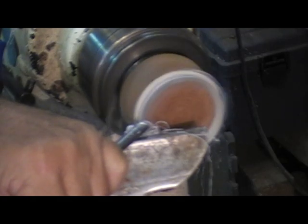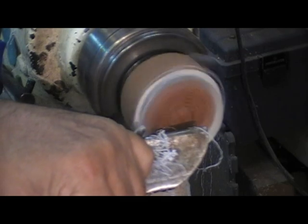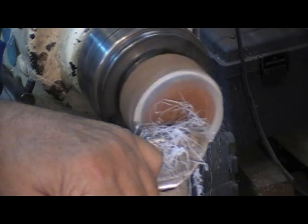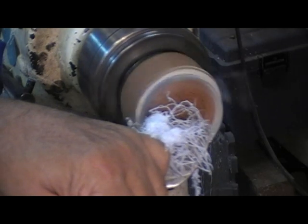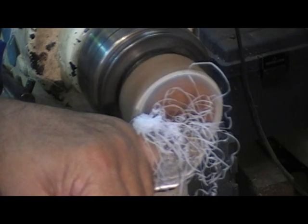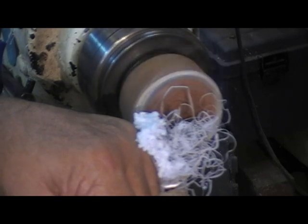If you're saying, Cap, why don't you cut it? All right, why don't we just make a couple of cuts and I can show you what could happen. It could cut so nice, it's unbelievable. But that would just get a true edge we can work with. This is a detail gouge. Cut really nice. Good sharp edge. Not a lot of energy, not a lot of push, not a lot of heat being built up. Key is nice, slow, easy approach.